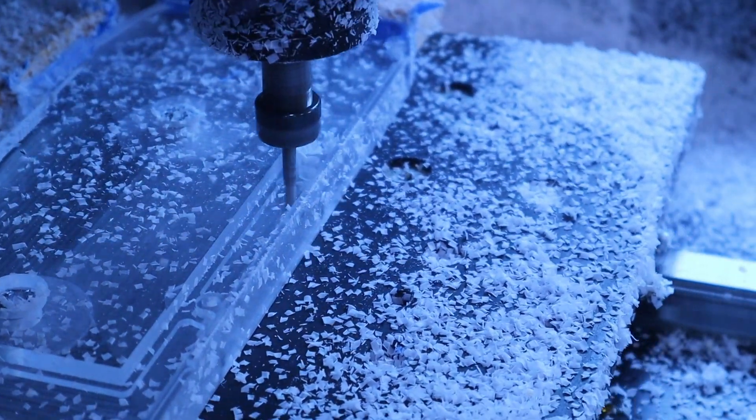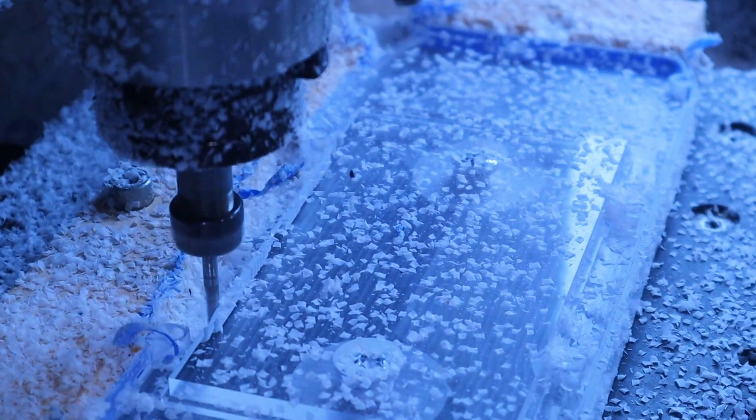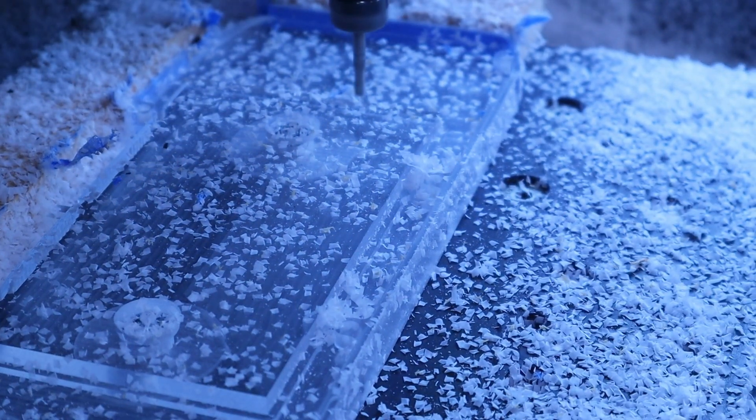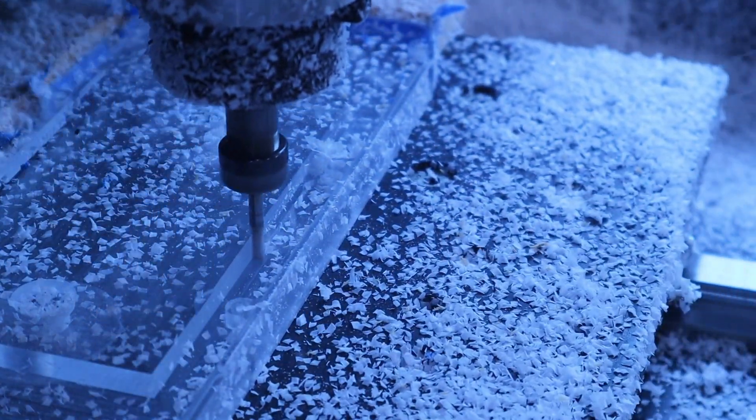Most of the work on the inside is just removing material with the 4mm end mill. In total, the machining for the front part of the housing took me about 10 hours of machine time, with at least 6 of those hours spent on the inside due to all the material that needed to be removed. I think the result speaks for itself though — I'm very happy with how this part has come out. It needs a light sand on the edges to remove the tooling marks, but I will do that once I have completed the acrylic housing so I can sand it all together to ensure I don't end up with any misalignment of the joints between the parts.